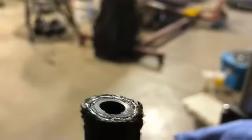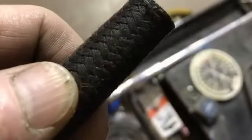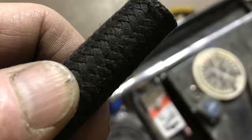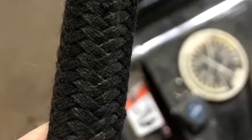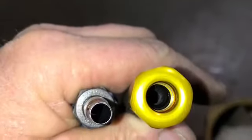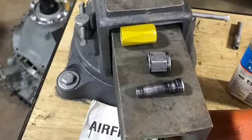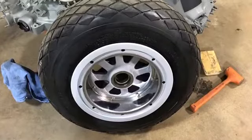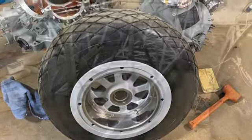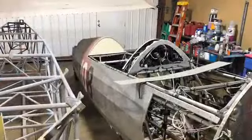Peeling that — that's actually canvas with paint, filler, paint, sealer. We were working on flexible brake lines down the landing gear, using the AN fittings there, trying to figure that out and manufacturing our own. Just put the tube over it, screwed — that's a pretty easy fitting. I did find a trick on the hose itself to trim that back and make it install a little easier. You certainly don't want any issues with that.